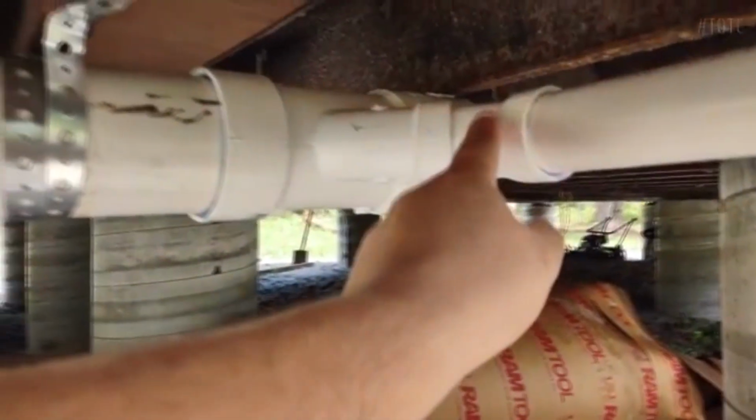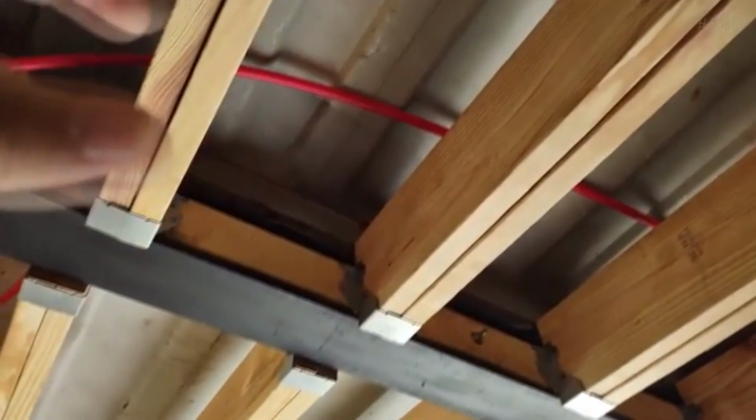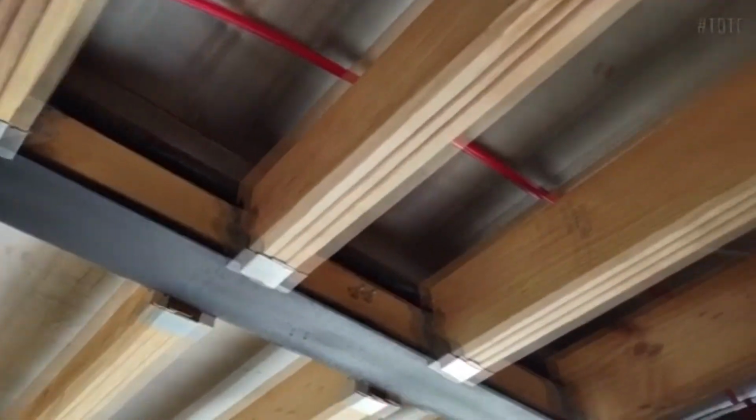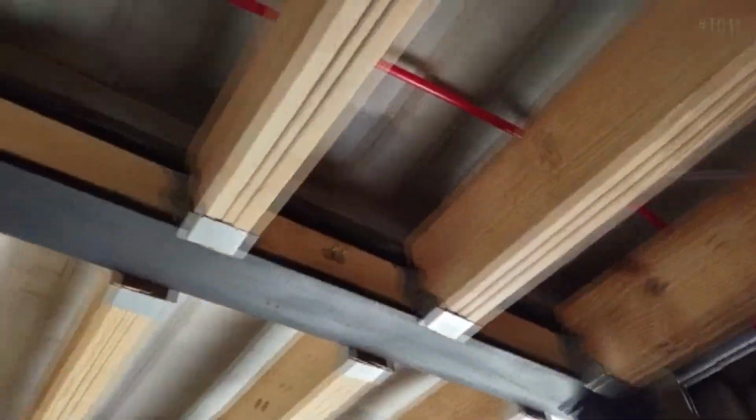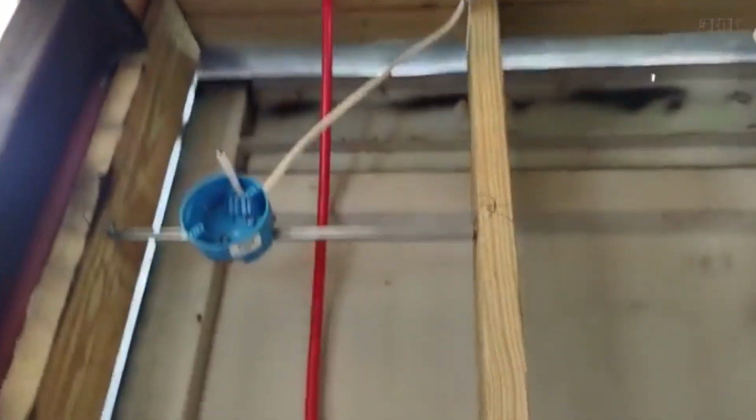The plumbing connection from the bathroom sink and the kitchen sink acts as a vent for each other. The drainage pipe from the laundry connects to the vent pipe, which goes up through the roof. The 2-inch vent pipe acts as a vent for the bathroom sink and a drain for the laundry.